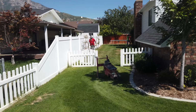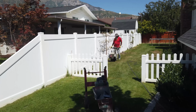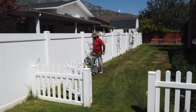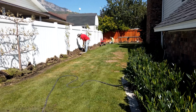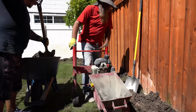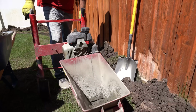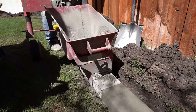Well, we just cut out the sod, we prep everything, like we just did. We make a little trench for it, and then we lay the curbing down inside of it. Can't be too wet, can't be too dry, it's just got to be perfect. You got to know your cement, for sure. And then Zach over here, he makes me look good, he'll trowel it. Zach's doing an amazing job. He's the operator.